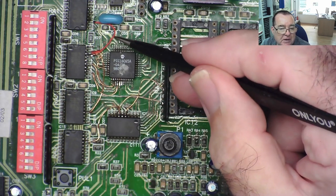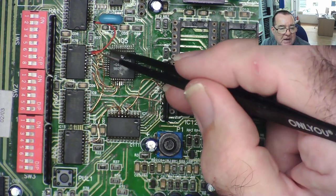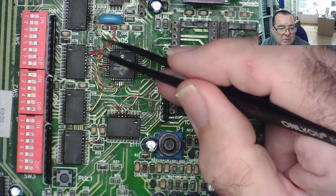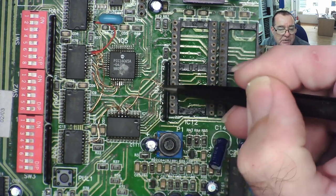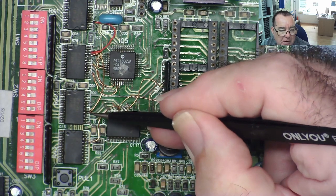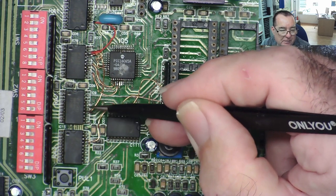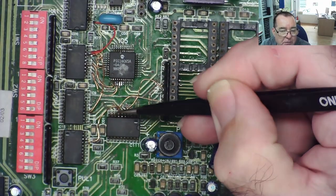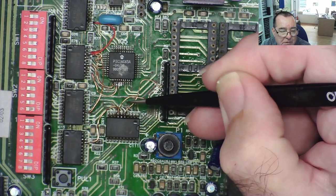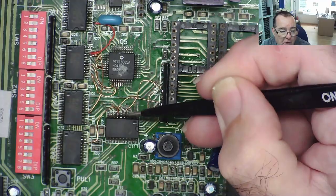I was trying to use this sort of wire, but as soon as I touched it with a soldering iron, it was melting the sleeving back. It was multi-strand, little strands were sticking where they shouldn't, and I found this much easier to use. So with this, you just get your soldering iron very hot and touch the end with a blob of solder, and it effectively melts the bit of enamel on the end, and then you can solder it. So for example, you can fold it double where you want to connect two wires to one pin. This is actually one piece of wire just bent sharply there.